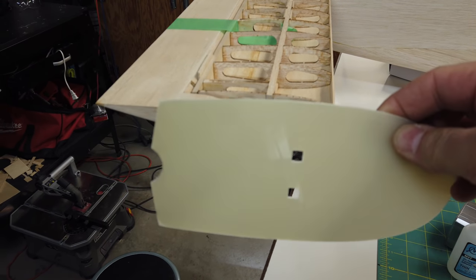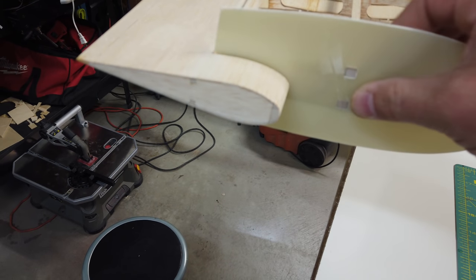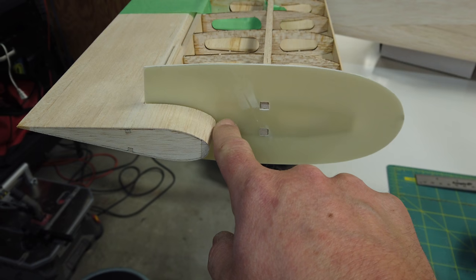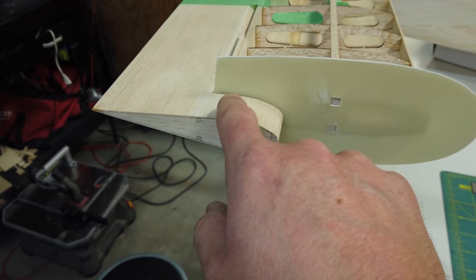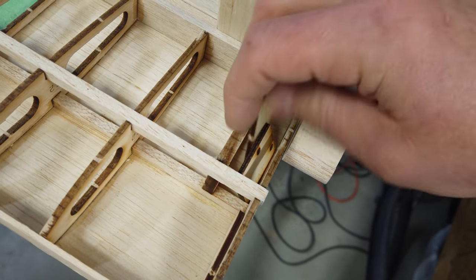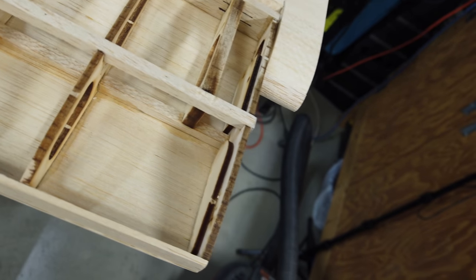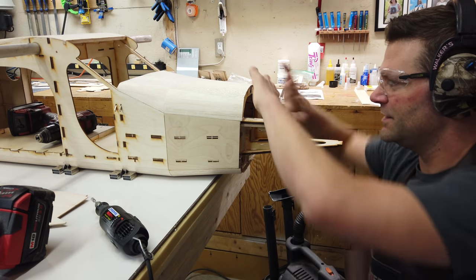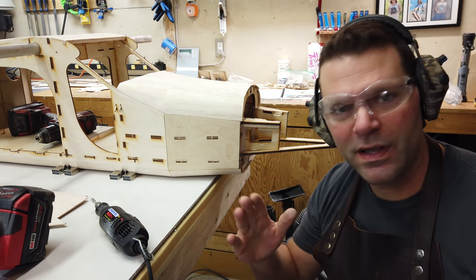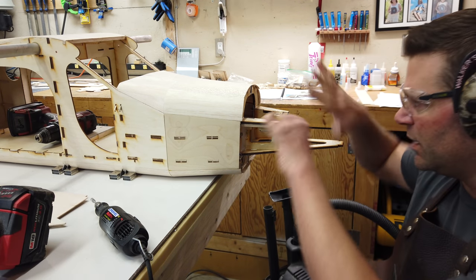The piece has worked out just perfect. The little half-moon shape still needs some sanding there, but it fits on just beautifully. The goal is we're going to put a blind nut close to the front edge and then another one in the middle area - we can't go back because it'll interfere with the actual elevator. We're going to add some spare pieces of ply from the kit as backer in there - one here and one there - and that will give us some surface to put our blind nuts in. Next we're going to focus on getting all of this sanded down to be flush with the firewall. The scale cowl butts right into the firewall on this plane, so quite a bit of sanding to do here.